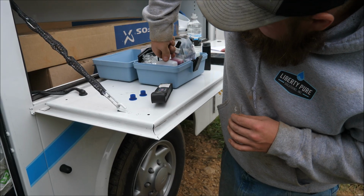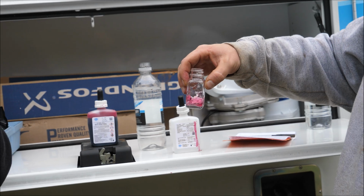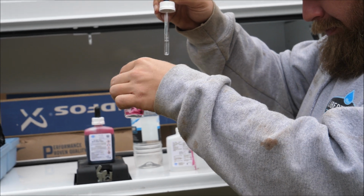Then the guys did a water quality test to see if we needed any sort of treatment. It's just like 6th grade science class. Luckily, our pH was right on and hardness came in at 7 grains. That's moderately hard, so I'm going to hold off on a full water softener system for the time being.